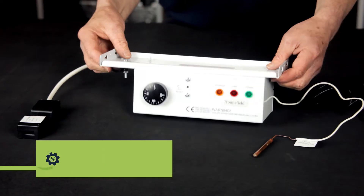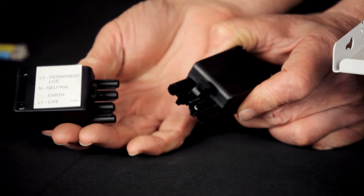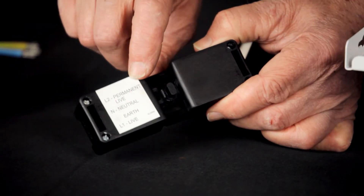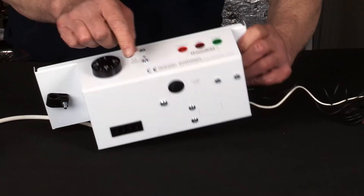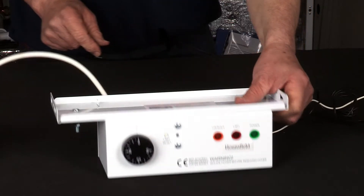The compact electrical control panel for the external boiler features mains power supply connected via a four-pin inline plug and socket, and a plug-in burner lead. A permanent live power supply is required to power the frost thermostat and test switch. A press-and-hold test switch avoids the hassle associated with the test switch being left in the test position.